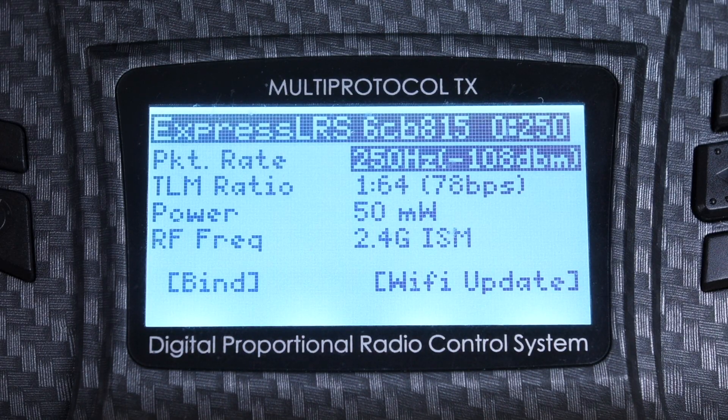On my radio I ended up having to update the version of OpenTX. Express LRS requires some special features that aren't in the main OpenTX yet, so it was necessary to download a special build of OpenTX and flash that firmware to my radio. The instructions for exactly which firmware I needed were on the Express LRS GitHub page — that'll be linked in the description. I also needed to get the Express LRS Lua script, which allows your radio to communicate with the module, giving you options for binding and configuring settings on the module. I put that Lua script on the SD card for my transmitter and was then able to access the external module and see those settings.